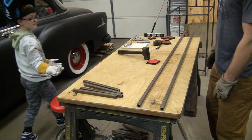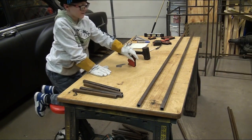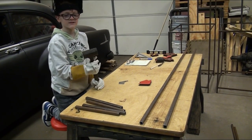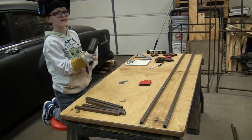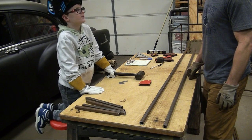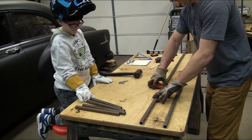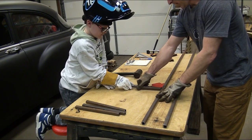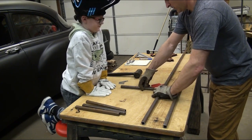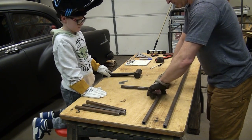Now we started marking the metal. When we're done marking, we're going to use the magnets and put them on where we marked it. We're going to put the level on it and see if it's square, and then use the hammer to lightly tap it up or down to make it level. We put a couple of marks on here. We're going to line this up and stick our magnet right there — we can do a magnet on either side to make sure it holds it in place for when we weld.